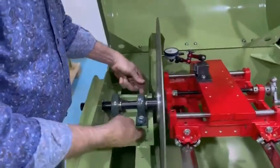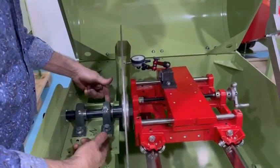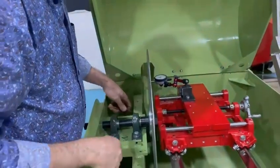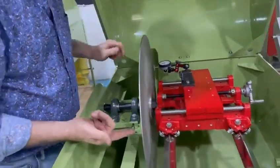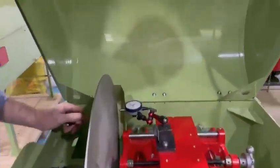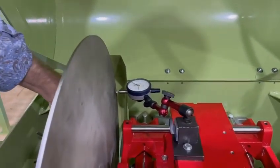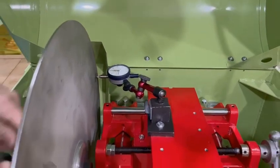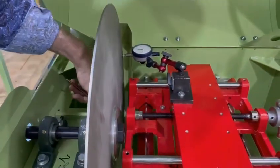I'm not going to mess with these screws; I'm going to focus on these screws. If I push this screw here, it's going to push the bearing, which means my angle is going to come back. On the first push I want to take half, because of the relationship — as I move this edge, this edge is also moving. So if I have 160, I want to move to 80. I'm going to run my indicator back until I get to 80, then start tightening these screws up a little bit so I have some pressure on the bearing at the 80 mark.